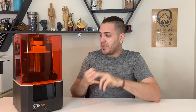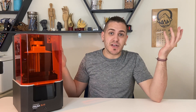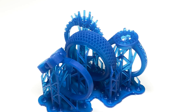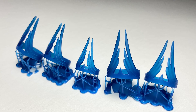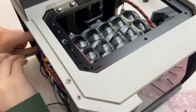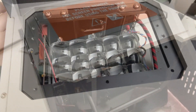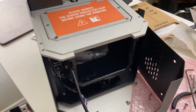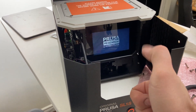So what do I think of this machine? I think this machine is amazing. Obviously we've been running it for a number of years and aside from a couple of screen changes and a few FEP changes, largely this machine has been maintenance free and it's been printing at a very high standard for quite a long time. The print quality is incredibly good and has just gotten better and faster now with this new upgrade. I can now fit more on the bed, I can print faster. There's been really nice firmware updates as well. The more public release of Prusa Connect — or Prusa Link, I'm not sure which one it's called now — has been incredibly useful. This machine has built-in Wi-Fi so I can go into my browser, drag a file over, and it prints. It's done.